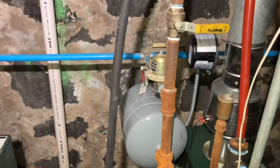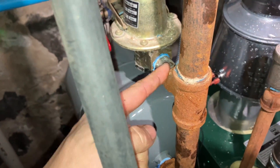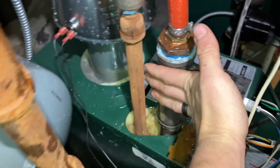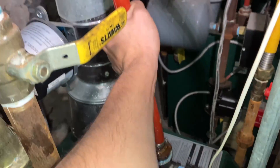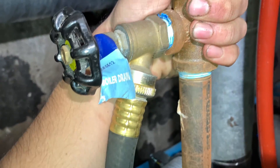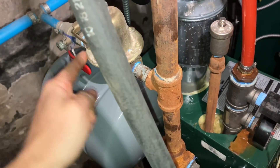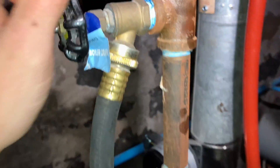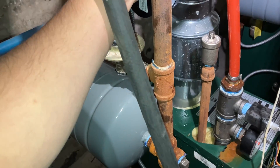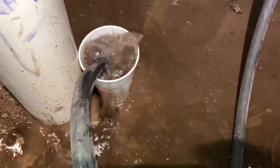We don't want to let the pressure get too high, but at the same time we don't want the system to pull completely down with no pressure, because then water's not going to be able to make its way around the loop. This pipe is cold because we have cold water coming in from the reducing valve. Now I start to feel it cooling off on the supply, so I'm just going to wait until I feel it coming out cool from our return — that way I know that cold water has made it all the way from this point, down through the boiler, up and back. Then we'll kick it on and make sure the thermostat calls for heat and heats up the boiler.